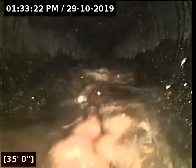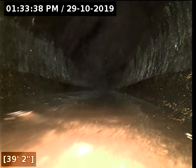So you can see there is some standing water — I have the water running from the kitchen sink. The head of my camera — when I'm pushing forward it actually pushes water and gives the illusion of depth, as opposed to when I'm pulling back, you notice it's not covering the camera head completely. So this is a small belly from about 34 feet to about 37–38 feet. I'm going to keep going because that wouldn't fail the line. I will note it in the report as being there, but it's not obstructing the flow.